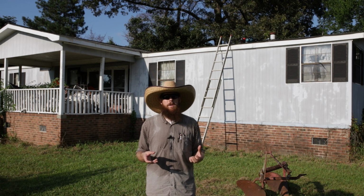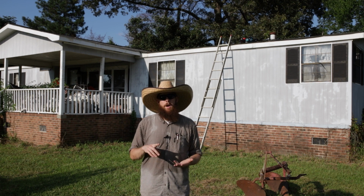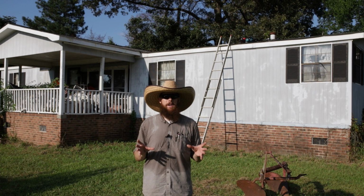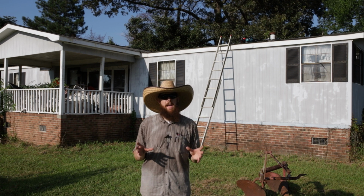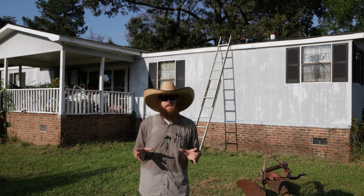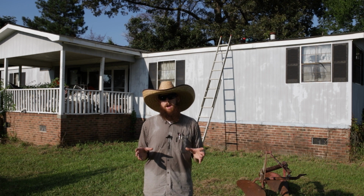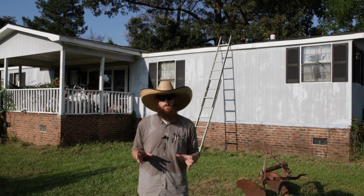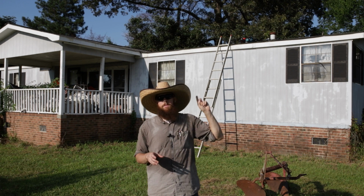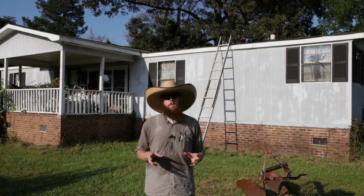And the basic rundown is, one, the roof is in really bad shape. We need to re-roof it. My old bedroom is where the AC unit attaches to the side of the house. When they replaced that unit back in, I believe, 2004, 2006, when I was still living in the house, they didn't flash it correctly, and we had some issues with the roof. And you may be able to tell, may not, there's a giant oak tree back here, and some of the limbs are hanging over the roof, which is a big, bad issue. And we got some rot going on.